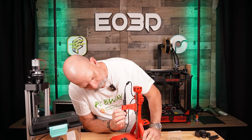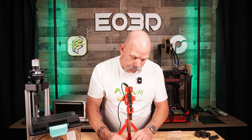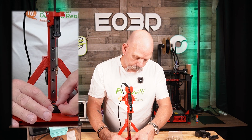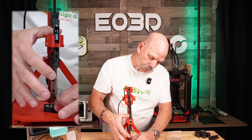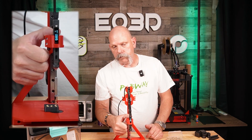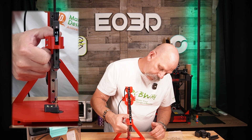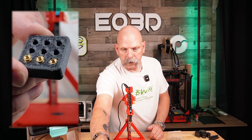Let's go ahead and bump it up to 340. I didn't get the best top surface on this print, so they're not really wanting to set in there to start. There's 340 — we'll give it a few seconds to heat soak the brass and then start to put some pressure on it. And at 340, it did go in, but it took quite a bit of pressure.